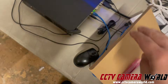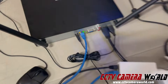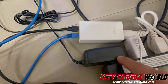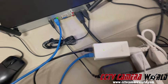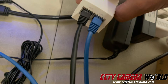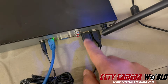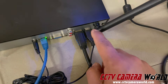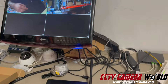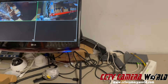The NVR — here's the back of it in case you're not familiar. There's a power connection with a power supply that comes with it. An ethernet cable from here goes to the LAN port on the PoE injector. There's an HDMI connection — please connect the HDMI cable to your TV before you power on the NVR. A USB mouse comes with it to control the menu system, and once you have a compatible monitor you'll be able to see fluid video with audio.